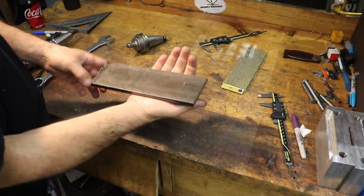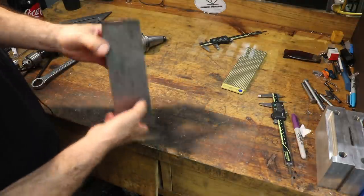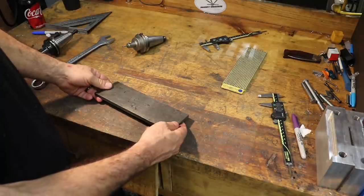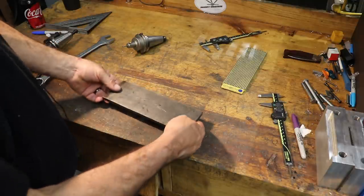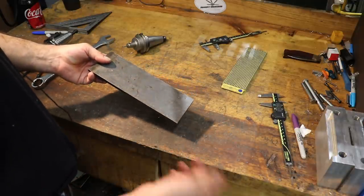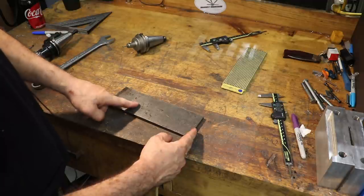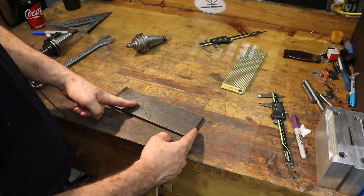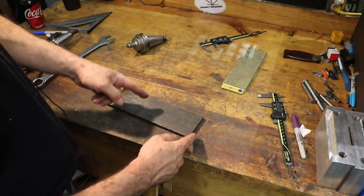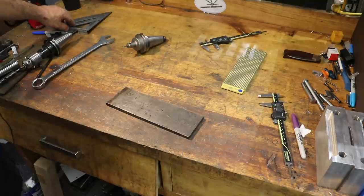All right, I found this piece of stock. It looks like maybe a cold rolled bar of 4140 steel, but I'm not sure. It looks like I plasma cut it at some point, but this stock we're going to use for the stripper plate, which is the final cavity component of our mold, and this plate is going to basically pull the molded parts off of all the delicate pins on the A side of the mold. So to do that, we need to, oh, and our mold is 6 inches wide, so I'm gonna rough cut out maybe 6.1 inches off of this stock in the saw, and then we're gonna load it in the Haas mill, and I've got a series of hole drills and pocketing to get basically this thing ready for our cavity machining. So let's go ahead and do that.